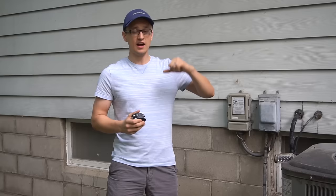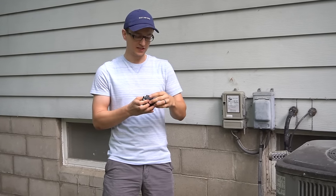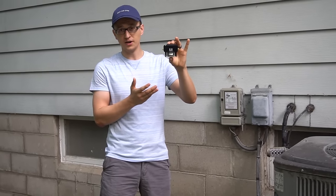So many times on my 'how to fix your AC' videos — I have about 15 of them now in my AC fixing playlist — people start in the comments by saying, 'My AC is not working, and I already tried replacing the contactor but it's still not turning on.' So I thought I would make this video to let people know that the contactor actually rarely ever fails.